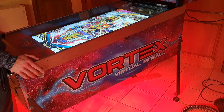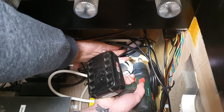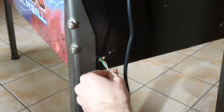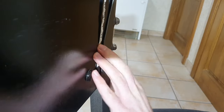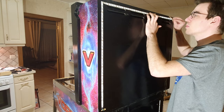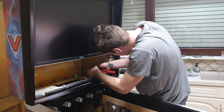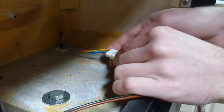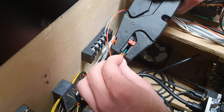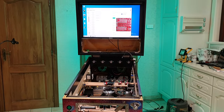Having installed the undercab lighting, I might as well expand it to the back of the cabinet and back box as well, as it's just some cheap LED strip. I first drill two holes in the back of the cabinet body — one on the left and one on the right — and also a single hole in the back of the back box. Just like the undercab lighting, I feed an LED strip with some wires through each hole and stick down the strip, once for each side of the cabinet body and once for the back box. On the back box, I make a U-shape along the top to cover all the sides with LEDs, bending the strip carefully at the corners to avoid damage. I crimp a connector onto the back box strip so I can easily unplug the LEDs when removing the back box. All the wires converge at a terminal block, which connects to the Pinscape. Once again, a really cool glow — this time from the back. The entire room is now illuminated.